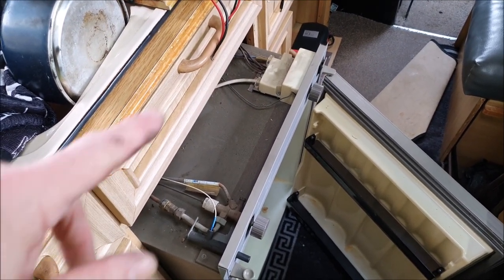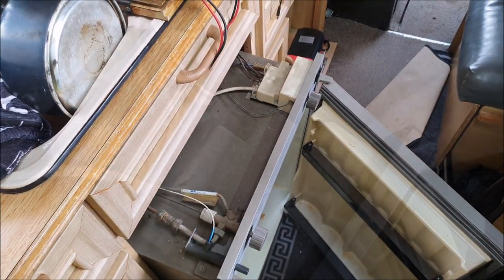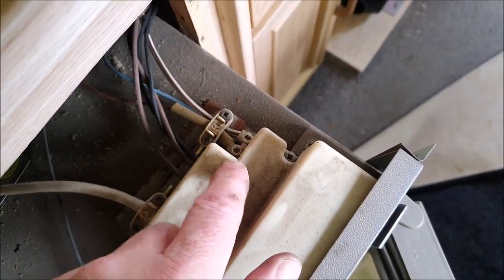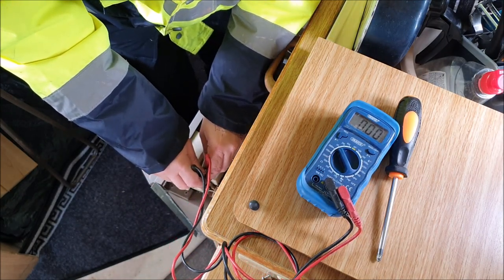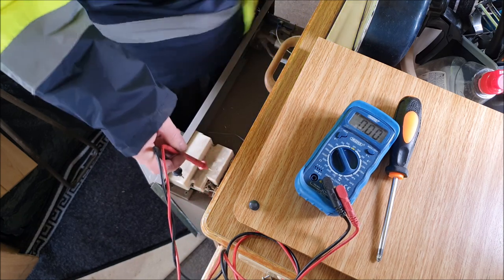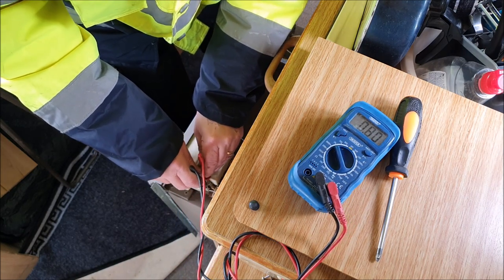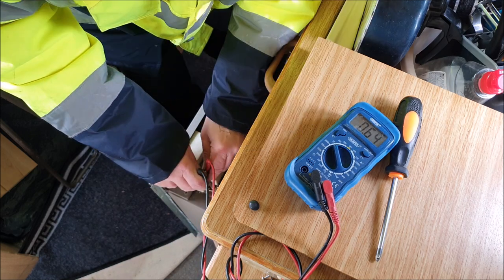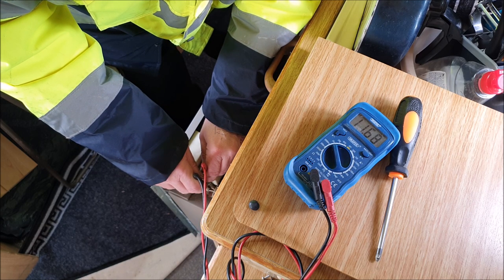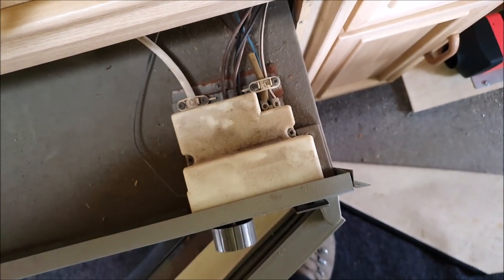So I've pulled the fridge out, and in the back there, we've got the switch that takes it from 240 to 12 volt. And I've got, of course, these 12 volt connections on the back there. So with that auxiliary switch off, yeah, there's no voltage there. But if I turn it on, your battery is probably in need of some charging at the moment, but I get a good connection. Yeah, there is nearly 12 volt there. Dear, that leisure battery does need charging, doesn't it? So I don't think there's any reason we can't pull our electrical power from there.